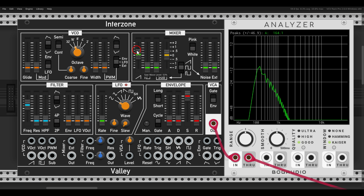We also have a high pass filter. A high pass filter will do more or less the opposite. It will attenuate lower frequencies, so lower than the frequency point. Right, you can see it keeps more or less the high frequencies, but it attenuates the lower frequencies, again lower than this point. And if we combine the low pass and high pass, we can get a band pass filter, so it will attenuate lower and higher frequencies, and will keep a sort of a band of frequencies.